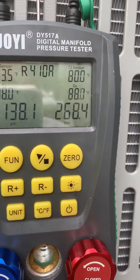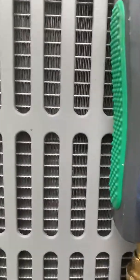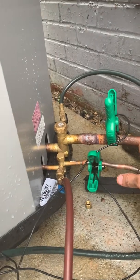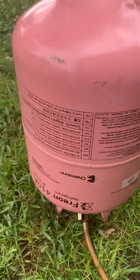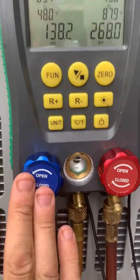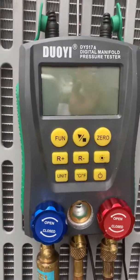The inside of the house is getting really nice and cold. I just figured I would show everybody how you do one of these particular units. As you can see, I've also got the Imperial vaporizer. What this does: when you're filling on the low side on the suction line, you cannot fill it as straight liquid - it has to go in as vapor, otherwise you can mess up your compressor. So I ended up buying one of these that goes into the suction side, and then you've got your R410A here flipped upside down because you want liquid, not vapor. You're not going to charge with the red side - it's going to be charged only with the blue, the suction side. If anybody has any questions, feel free to message me. If you like my channel, please subscribe. Thanks, have a great time.